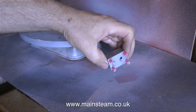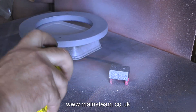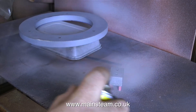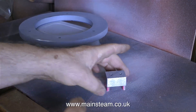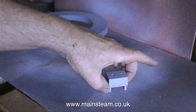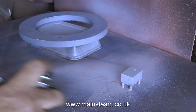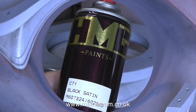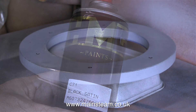Now in the outer part of the workshop, right next to the boiler's base, I'm painting this block with etch primer — Precision Paints etch primer, as I've shown in previous videos. And another health and safety warning: if you're doing a job like this, particularly with etch primer which is very nasty, you need to wear a breathing mask, and any painting should always be carried out in a very well-ventilated area.